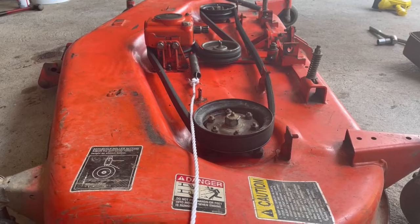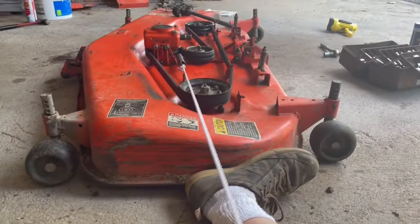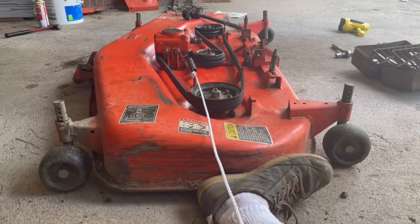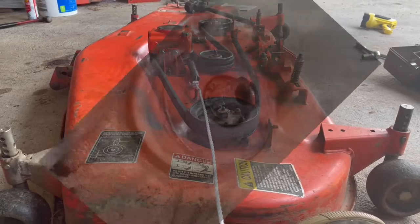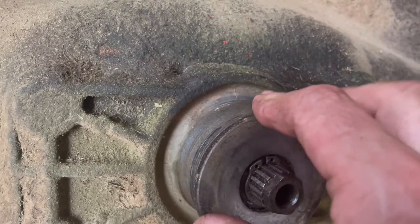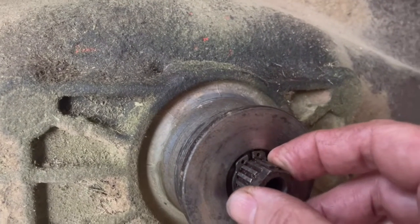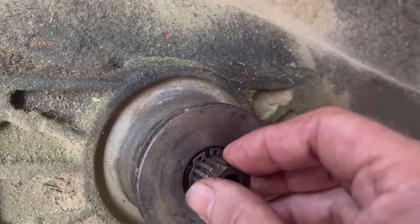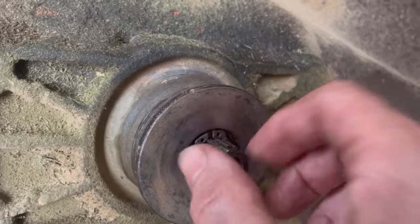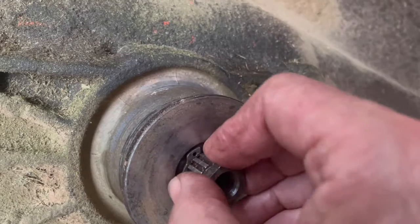One more quick thing, you can tie a string on the end of the spring, and the other end on a little handle. And you just pull back and slip it over and take the string off or cut it. Whole lot easier. One thing I want to point out, when I put this back on, just my luck, that little slot that the ring clamp sits in was barely showing at the edge. The ring wouldn't lock in. I was like, oh my goodness. Did I not drive the shaft all the way through? I mean, it was just a millimeter, but it wouldn't go in.